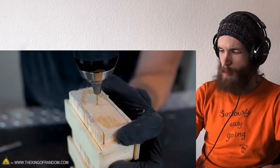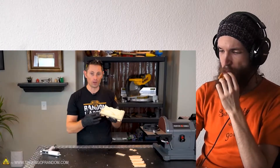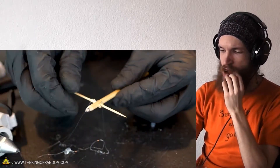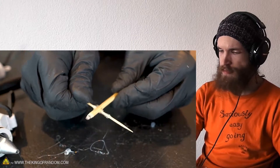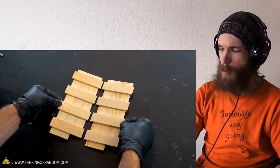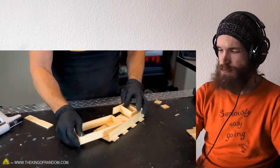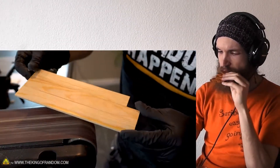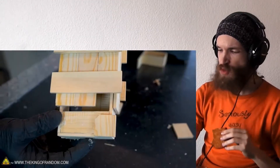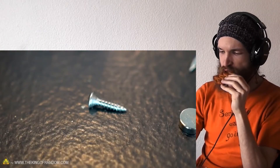Drill a very small hole in the back and center of the box. We've got the long sidewall on and the back glued. Use glue to secure the toothpick into that hole, then very gently break off the ends evenly. Set them down on the table and push them side by side — you can see they line up absolutely perfectly. We got these things glued together and sanded. Now we're going to add the mechanisms that allow the mystery compartments to open.